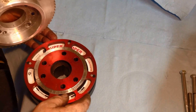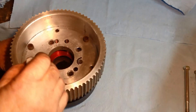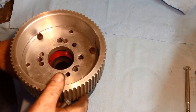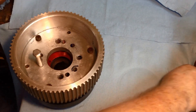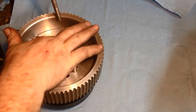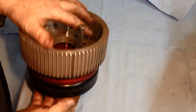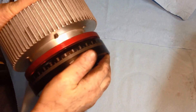So when you put this on, you set that on there, then you set the pulley on here and everything is indexed. I've marked which hole it is that you want to go into, so when you set it on there, you can instantly drop your bolts in and everything lines up very well. These bolts are too long because they're just my mock-up bolts. But now I've got a very solid piece on here — there's no run-out and there's no alignment problems.